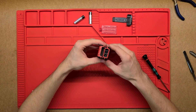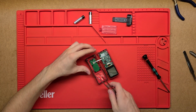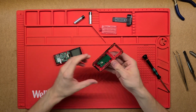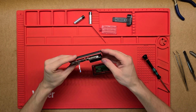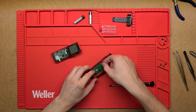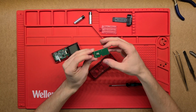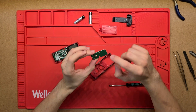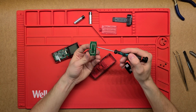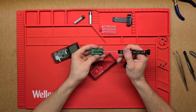It seems like it's just two parts — a clamshell — that snap open. We just have a little ribbon cable that comes loose, going to the buttons. A couple more screws here, so let's dig into that. This bottom bit is just a super simple PCB — this side has just a ground plane and then a little track over there, with a via that comes through to that button.